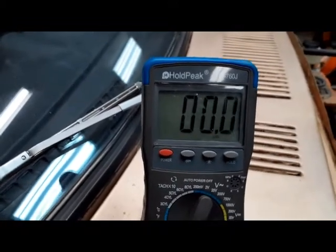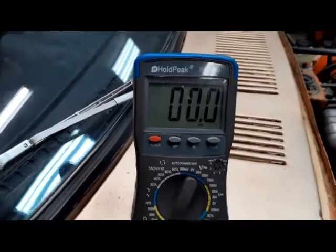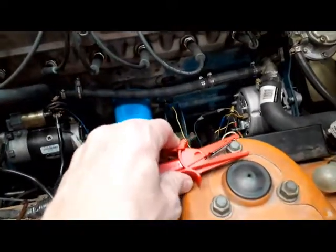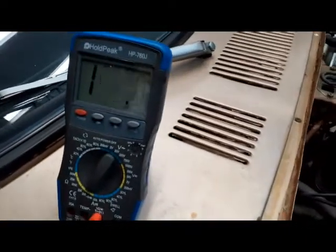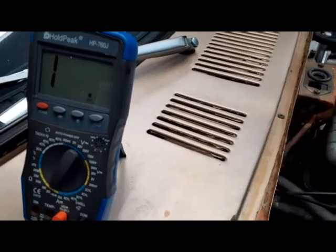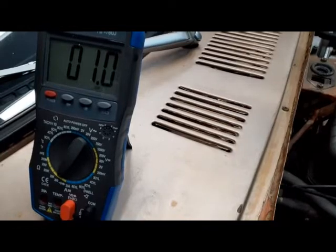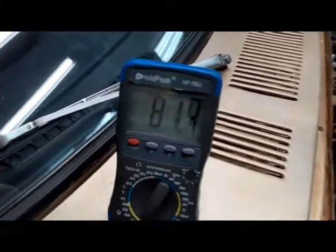If you're seeing values on the other side of the decimal place, the first thing you want to do is make sure you're holding the probes of the meter firmly against the surface you're testing. Here, just pressing it against the surface not very firmly, you can see the readings are fluctuating a lot — that indicates not having good mechanical contact.